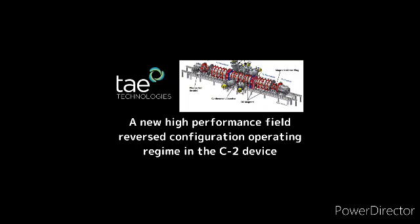The Plasmagun and the end plugs have many potential benefits, such as improved FRC formation, edge layer confinement, particle refueling, stability through line tying to the gun, neutral gas control, radial electric field control of the FRC rotation, and creation of EXB velocity shear. Some of these benefits require a cold and dense plasma stream, while others require a hot, tenuous plasma stream. The AMBAL Plasmagun is capable of producing either hot or cold plasma.